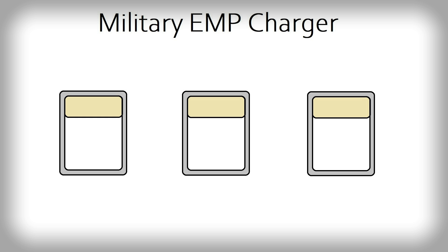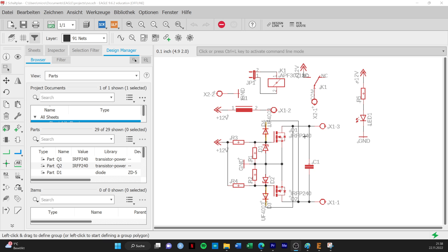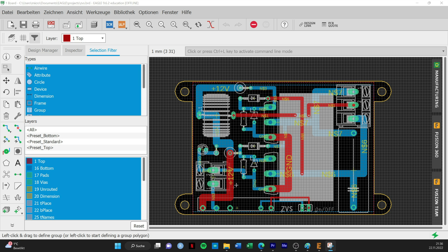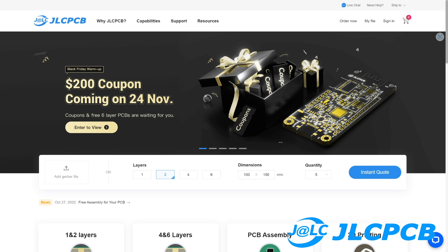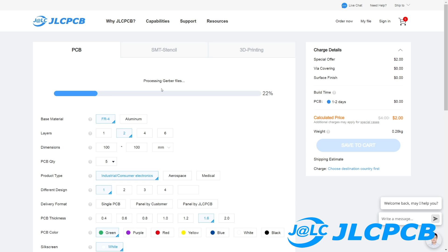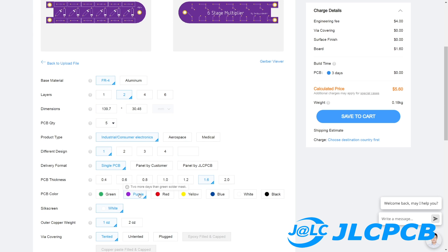Now we just need everything else. The 50kV makes things a lot more complicated. Let's go one by one. How do we charge the capacitor? The charger basically consists of three parts: a ZVS circuit, a flyback transformer, and a high voltage multiplier. The ZVS driver runs the transformer, and the transformer runs the multiplier — quite simple in itself. Using the layout editor Eagle, I created two PCBs: one for the ZVS driver and one for the high voltage multiplier. Luckily JLCPCB is the sponsor of today's video. To order, we just have to upload the Gerber files of the two PCBs on JLC's website. I think purple just matches best with an EMP generator.